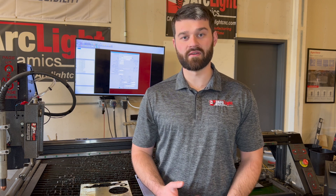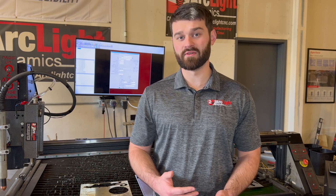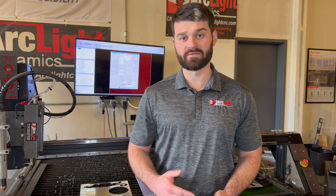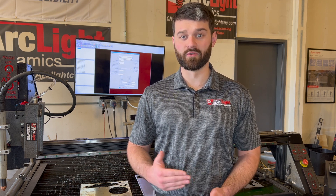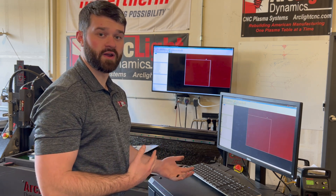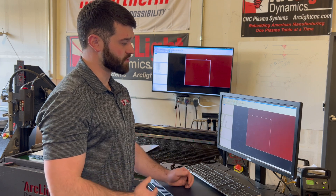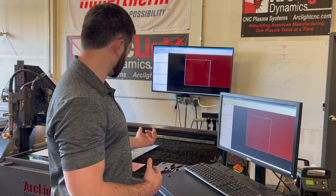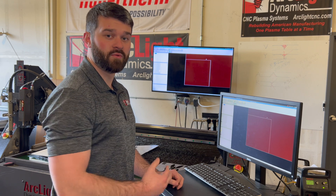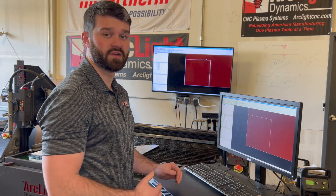Where I like to start when it comes to making a tool for whatever I'm trying to cut, I like to start with a similar thickness material and then work my way from there — first figuring out a feed rate, and then a voltage. I'm going to start by setting a tool path on a 2x2 inch square for quarter-inch aluminum, since that's close to what we're cutting with this 3/16 aluminum here. We don't have a tool for 3/16 aluminum, so we need to figure out our cut speed and voltage to get this cut.